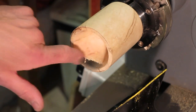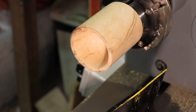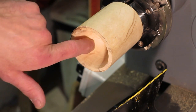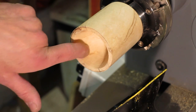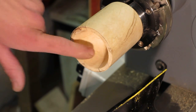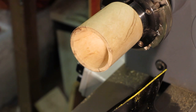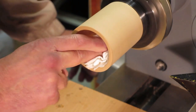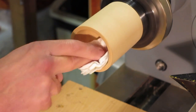To finish the inside to the depth I wanted, I hollowed it out with a half-inch spindle gouge, and then used a square end scraper just to get the wall vertical before going in to round off the bottom. That'll be sanded now through the grits up to 600, and then finished with the usual two coats of sanding sealer mix and wax.